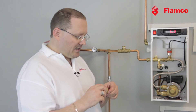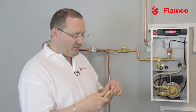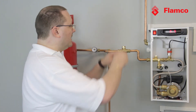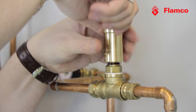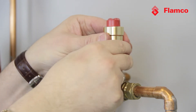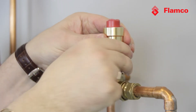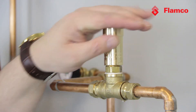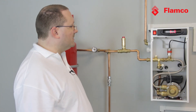So this is the damaged vent, and I'm just going to install it. We will expect this to leak. Here we can see water is coming out from the vent. But in truth, a lot of water should be coming out of that vent and it's not. This is because the fibre washers have already started to swell and they're locking off the vent.